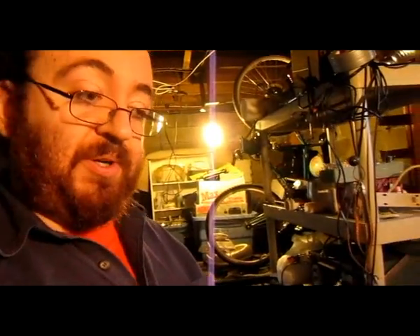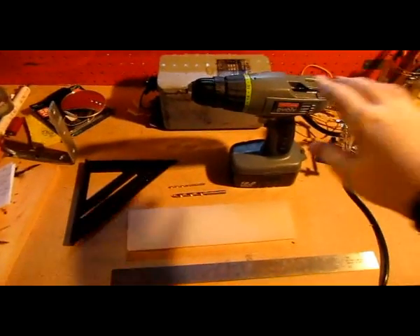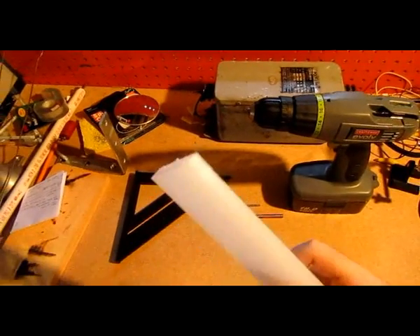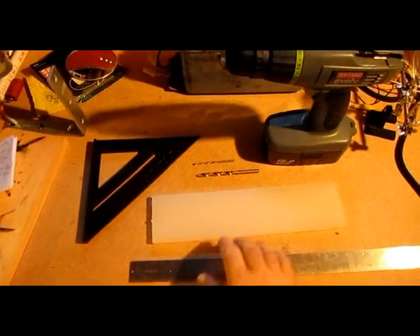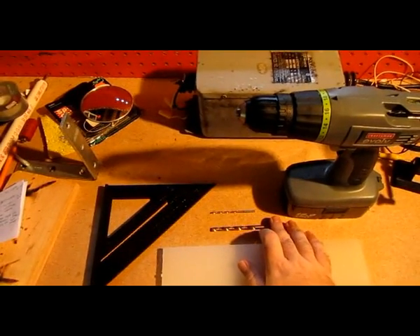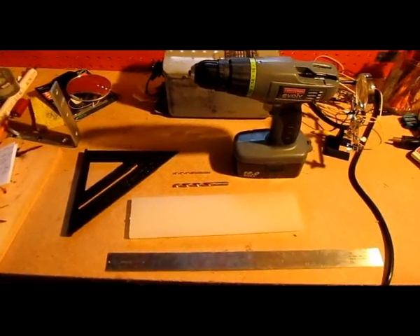Welcome again to another technology program. Today I'm going to go ahead and make the plastic former to support the primary coil in my larger Tesla coil. Here are some of the tools we'll be using today: a drill to make holes in our plastic support material, a square to make nice even lines, a ruler, a 1 and 1/8 inch drill bit for the pilot holes, and a 1 and 1/4 inch drill bit for the actual holes. We're going to put 1 and 1/4 inch copper tubing as the primary coil.